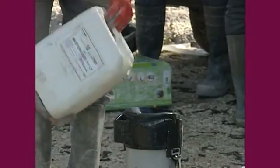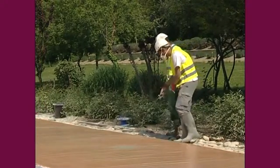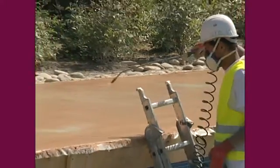The evaporation suppressant plays a very important role in Artevia Print. When there's very little humidity, when you have a very dry environment, the evaporation suppressant really comes into its own. It prevents a phenomenon called crusting on the surface of the concrete. In other words, it means your concrete won't be very hard on the surface and flexible underneath.